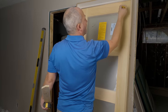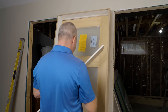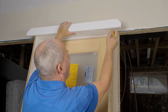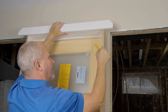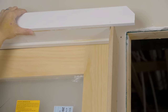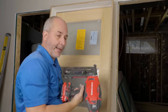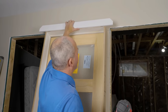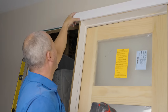We're going to do this now — take the same eighth. I'm going to use my finger as a stopper and put my mark on each side. This measurement plus casing plus an inch to get us our detail means that I measure back with two and three quarters for the trim plus an inch, which is three and three quarters — I make my mark. Make sure you're looking straight at it, not on an angle because that'll lie. That's the location we're going to want to nail. When you're working with door jams and adding casing — especially with MDF — you want to use the thicker nail, the 16 gauge. The 18 gauge is great for wood, but for this kind of material the heavier gauge makes it stick better. You want to use short nails — inch and a quarter is plenty.